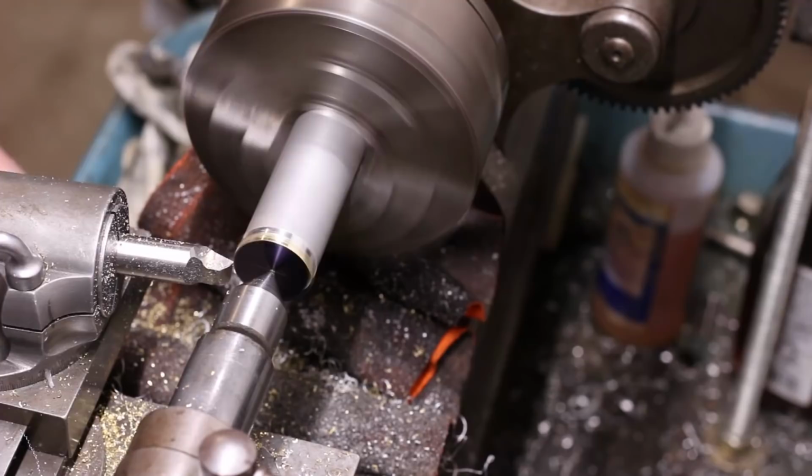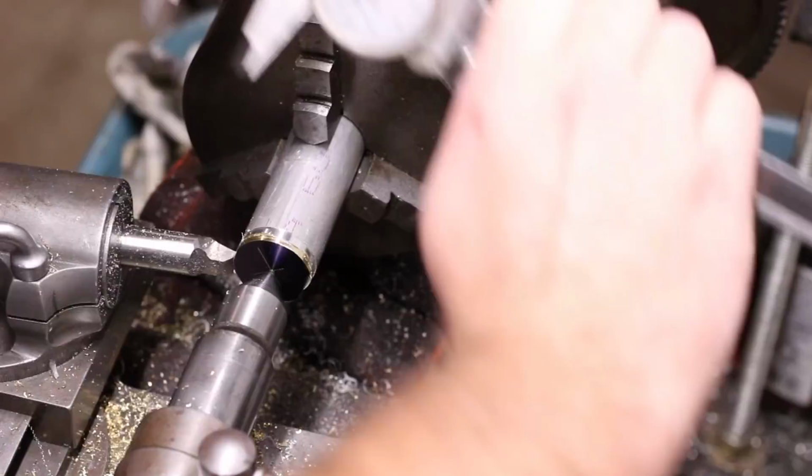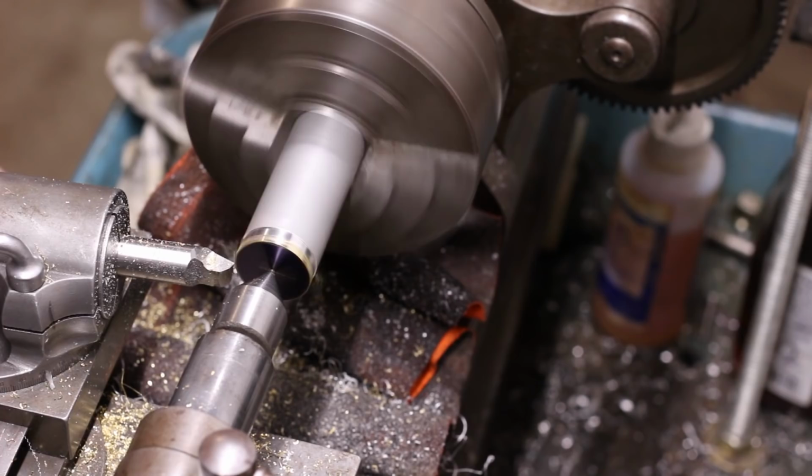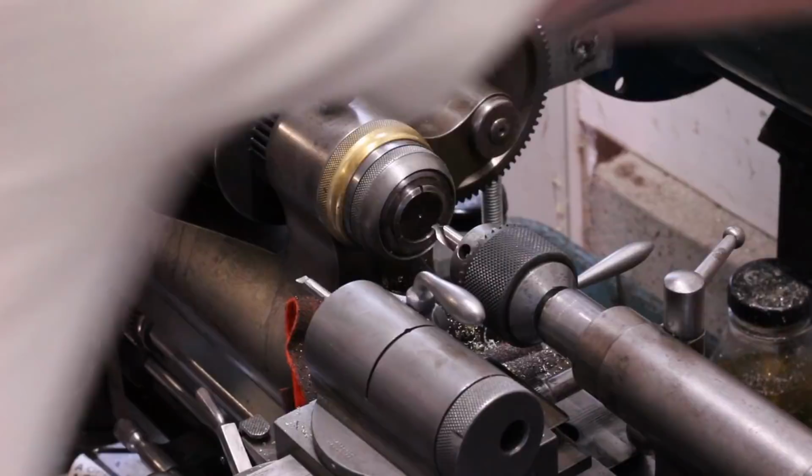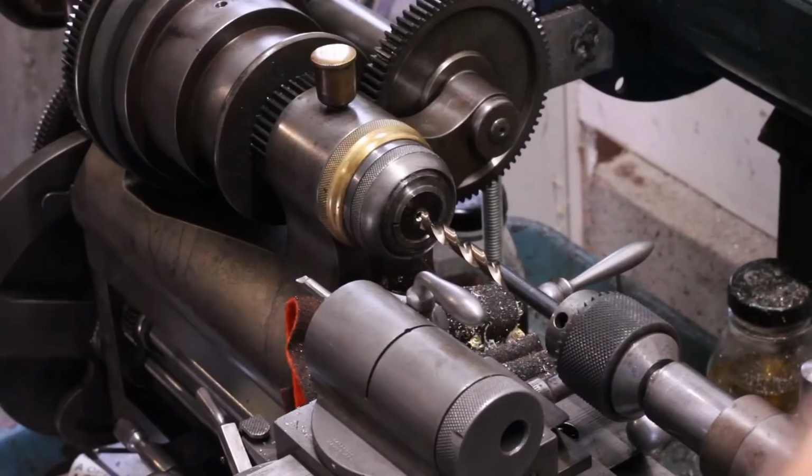I've probably mentioned this before, but be careful of cutting pressure and heat when using a superglue chuck. Make sure your tool is good and sharp, and don't let much heat build up in the work. It doesn't take much to soften the superglue. Once turned to the correct diameter, the retaining plate blank is transferred to a step collet for drilling and boring the center to size.